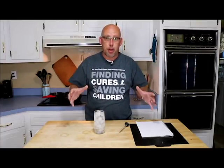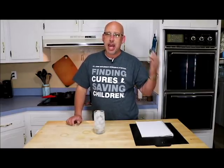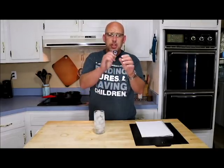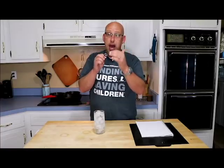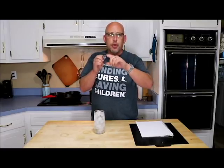So how do you calibrate an incubator? You're going to need a couple of things. First and foremost is an external thermometer. The thermostat on an incubator cannot be calibrated itself — you're going to have to do that with a thermometer that you know is accurate. This thermometer is a dial reading that goes from zero degrees up to 220 degrees, and that is important. You want to make sure it reads low enough, because a lot of cooking thermometers don't go below 100 degrees. I'll put a link down below for this specific thermometer — super cheap, maybe five bucks.